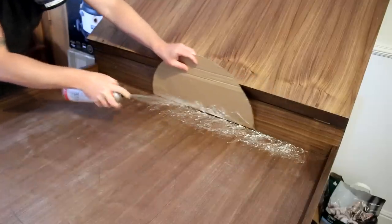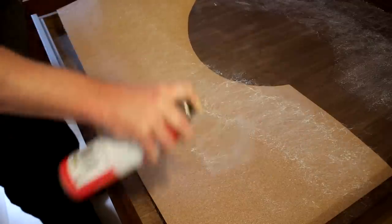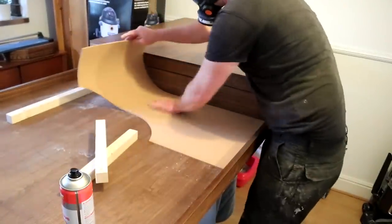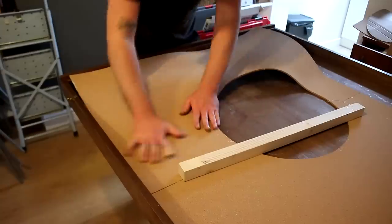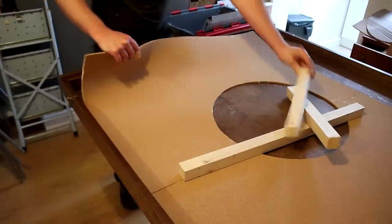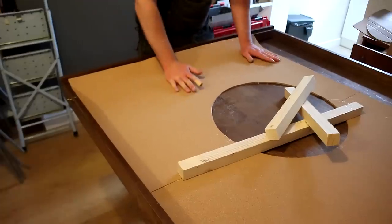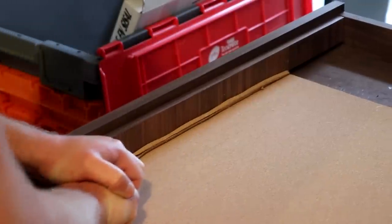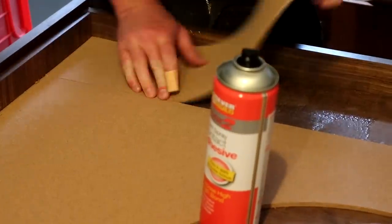The glue I'm using is spray contact adhesive which needs to be applied to both surfaces. I've said before I would never use contact adhesive again and I'm breaking that promise, but the spray version is much easier to work with. I used pieces of wood to stop the two glued surfaces touching so I could position the cork correctly, because once they stick you can't get them apart. I realised I wasn't going to be able to tuck in the top edge because it already had glue on it — in hindsight I should have left an area without glue. Instead I used a block of wood to push it down onto the glue, then trimmed off the excess with a knife. It wasn't perfect but the client is going to be covering the entire back panel with fabric later on anyway.